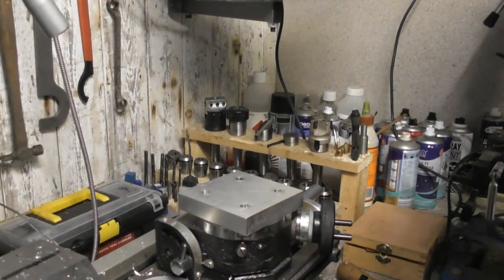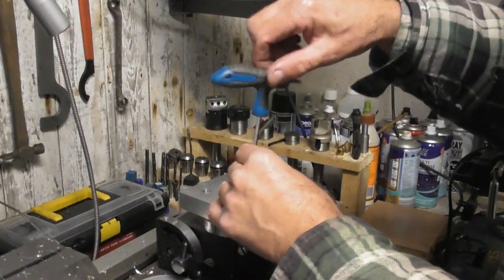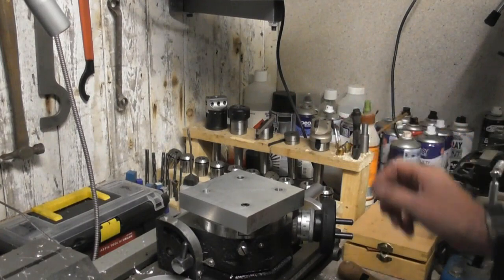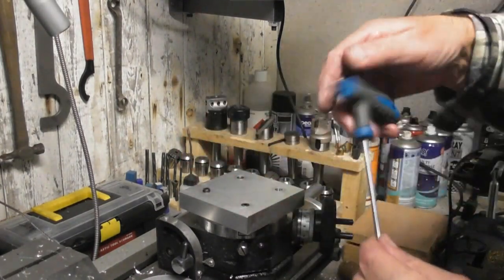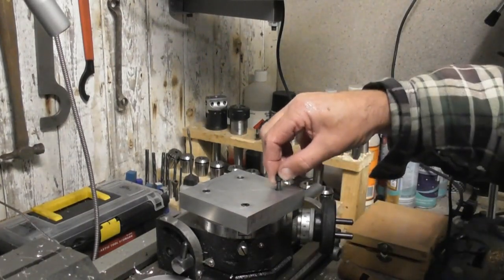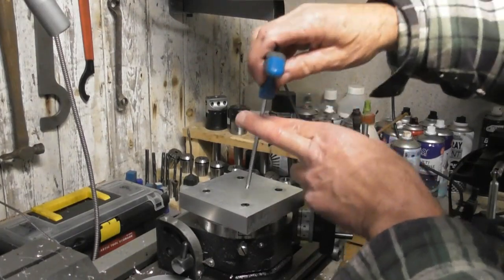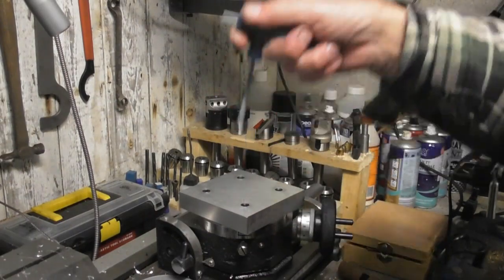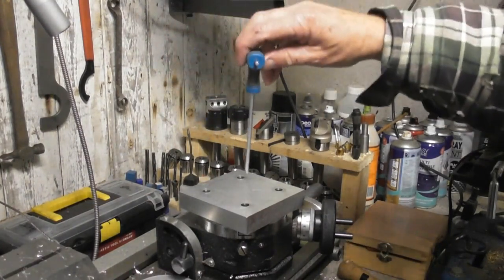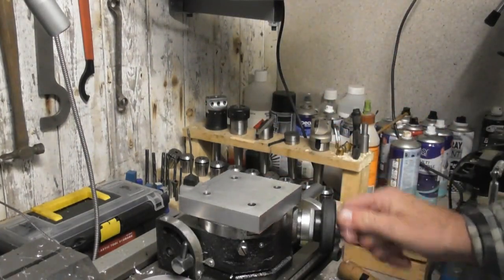Okay. Just on a little test fit now. I've got one in. I cheated. There again. Never tighten your first one up or your second one. Just leave them slack. Because there's not a lot of tolerance with it. I didn't want it too baggy holes or anything like that because it'll just shake loose. Oh yeah, worked a treat. Yeah, just touched it out with a reamer. I've deburred everything underneath. Nice snug fits. Yeah, and there we go.